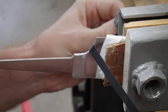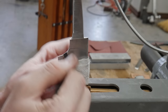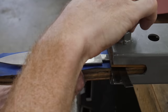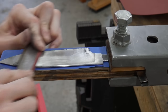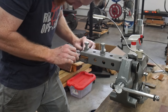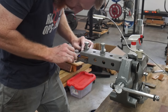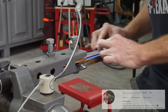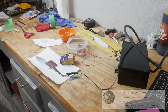I then moved on to my blade bevels, starting with 320-grit sandpaper and a hard backer, sanding to a diagonal scratch pattern, and then eventually along the length of the blade with 600-grit paper. A 600-grit finish will be as far as I take this knife before etching the Damascus — the uniformity of the 600-grit doesn't need to be perfect; in the words of Nick Wheeler, it can be a 'dirty 600-grit' at this point.